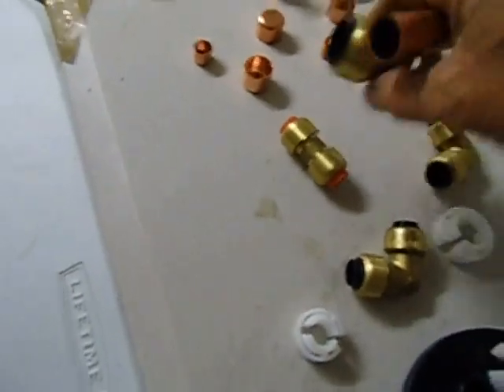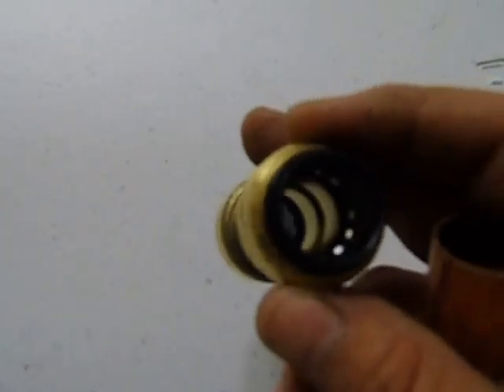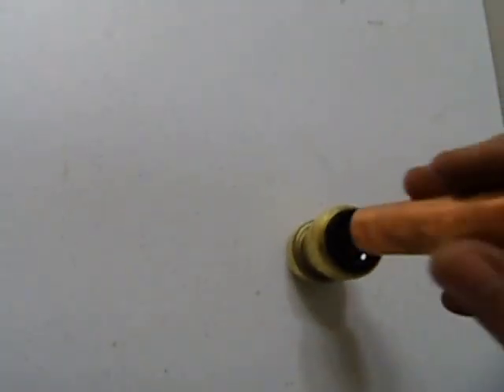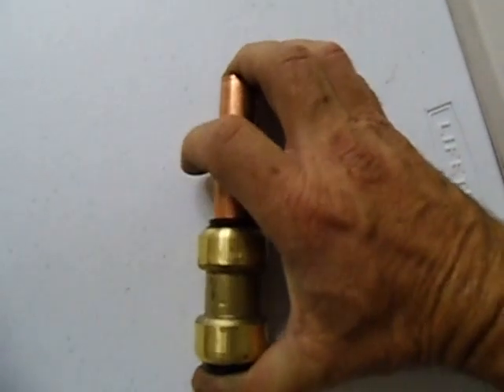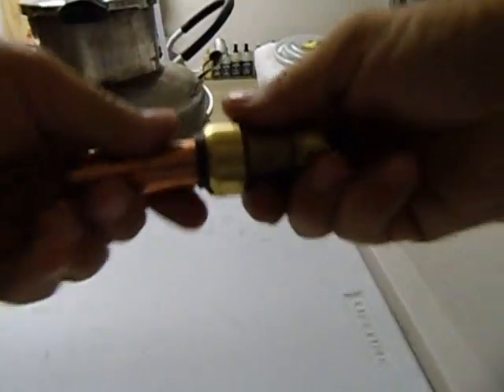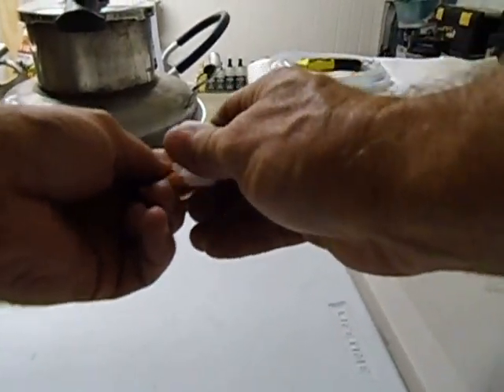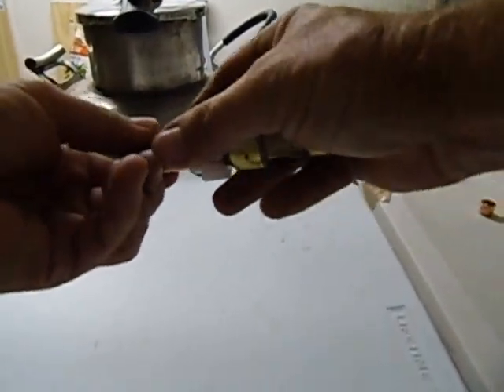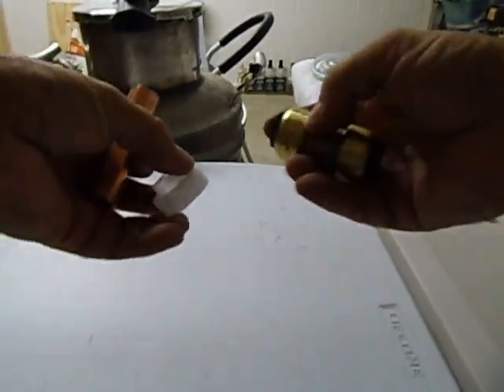This is one of the fittings — I'll just show you one of them. It's got an O-ring on the inside and little clips on the inside that hold it apart — they call it a clip seal or tube fit. Then this copper tubing just goes in like that. There's a little O-ring on the inside of these, it seals it, and the clips hold it in place. You've got to push it in. So there it's clipped in and it can't pull out. Then I've got a special tool here — it just slips over the pipe like that. You pull this part back, and you pull the hose out, get the copper tubing out, and it's all released. Very easy, very simple.